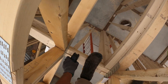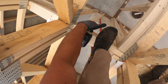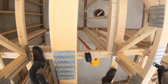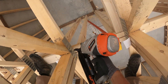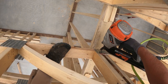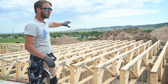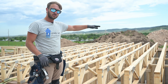I like to nail it plumb in a couple of places and then go down and nail the whole wall. We're right past our plate down there, right past our plate here. Check the line — good. We got our floor trusses all flushed up, nailed off, load bear point shimmed level and plumb.